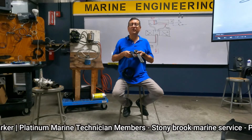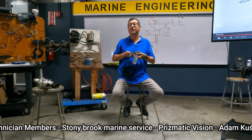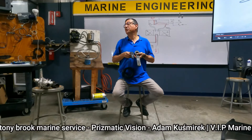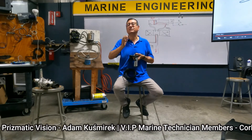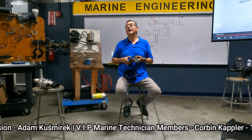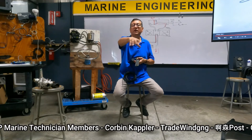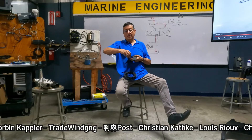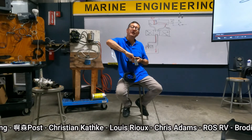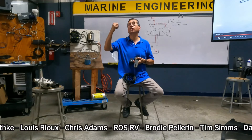You need to put the rudder straight, start the system, and press synchronization. The system is now synchronized with that position as zero. After that, if you move to one side, it reads seven degrees to the right. Before you start entering coordinates, you need to synchronize the system. If somebody working at the transom removes or bends the link, you need to replace the link and synchronize again.